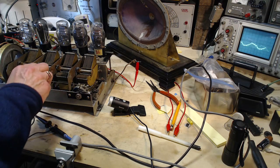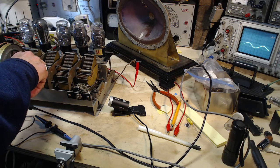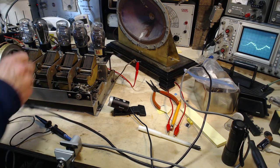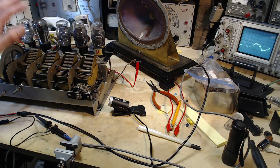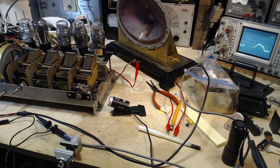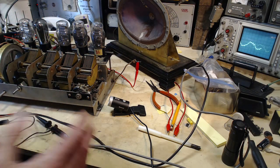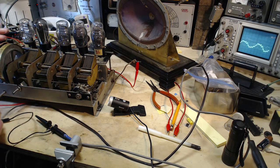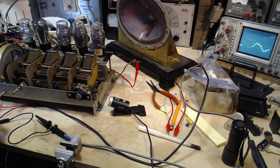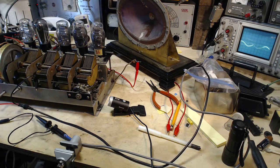Ground should be the same effect. Yep. Now it's a little hard to appreciate, but the radio right now is plugged into an isolation transformer. And the result of that is there's no relativity to ground, I guess I can put it that way, to Earth. So until something is connected, this whole thing is just kind of floating here, a gigantic antenna in all respects. I put this on, and it changes that quite dramatically.